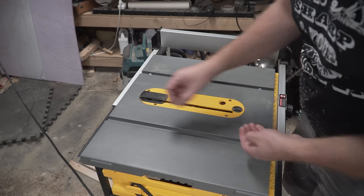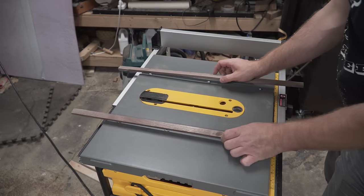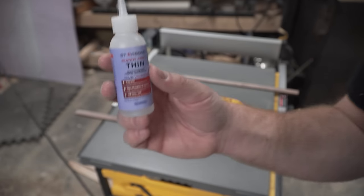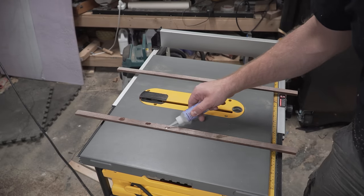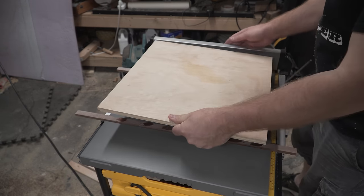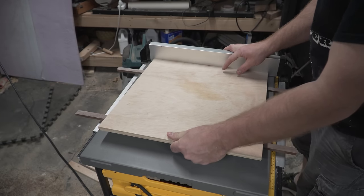After the runners are cut, you use a couple of spacers — in this case bolts in the miter slots — to bring the runners proud of the surface so you can attach the plywood base. Superglue is a great way to temporarily attach runners to any shop-made jig. I was recently sent a sampling of Starbond's new adhesive and their accelerator, and this has been vital to life around my shop. If you want to try it out yourself, you can pick some up at my affiliate link in the description. It helps me out just a little. Thanks.